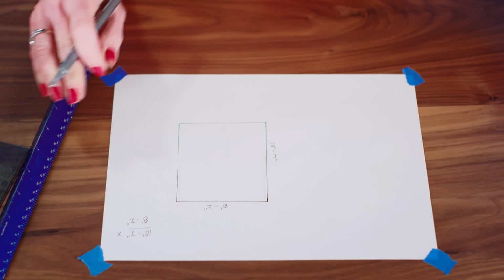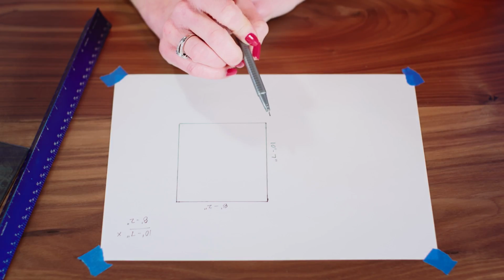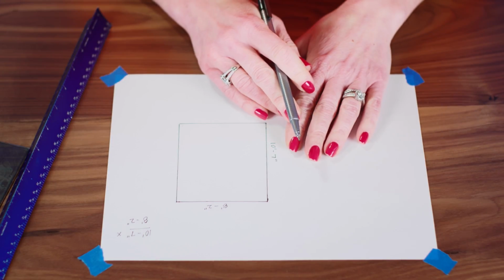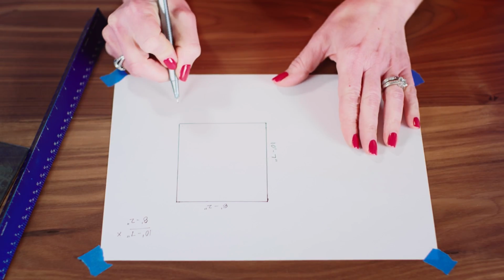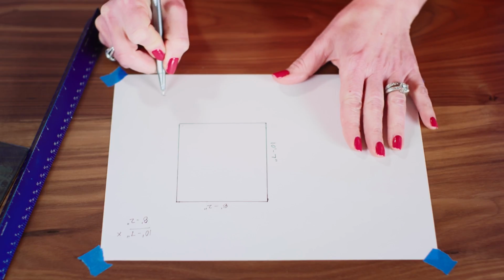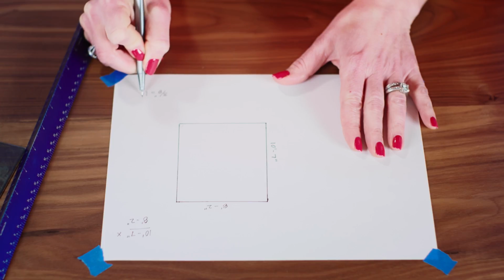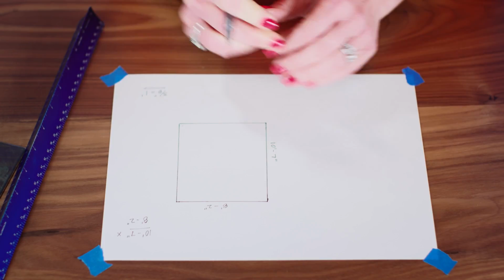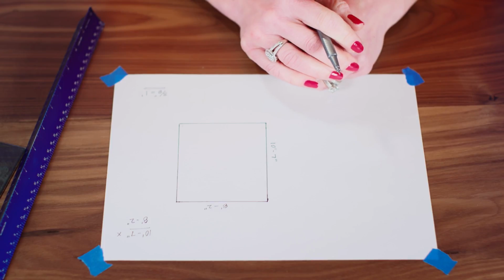And then that's our 10 feet 7 inch room by 8 feet 2 inch room, or box, if you will. One of the first things you really want to do is write the scale before you even get started, which I should have done first. But 3/8 of an inch equals 1 foot. Any architectural drawing that you look at will have that on there, or should have that on there.